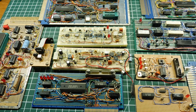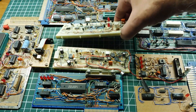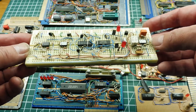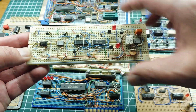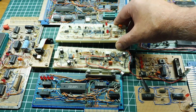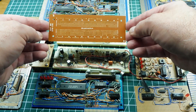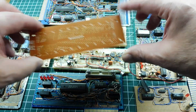In this video, we're going to look at circuit prototyping. I've done a lot of prototyping, so I'll go through some of the techniques that I use and the products that are available. Many of you are probably familiar with a solderless breadboard, like this one here. They're very common and easy to use, and they have the isolation channel down the center where you can straddle your ICs across. They also make a solder version of this board, which is the same size — it mimics the solderless board, and you could actually just take your layout from your breadboard and put it on this board here.